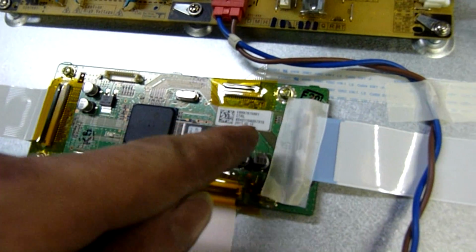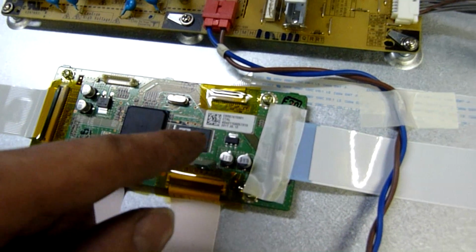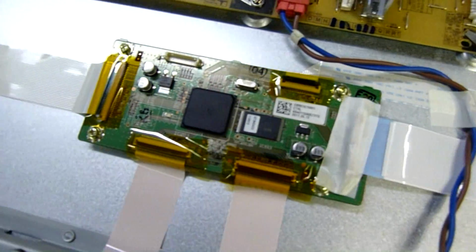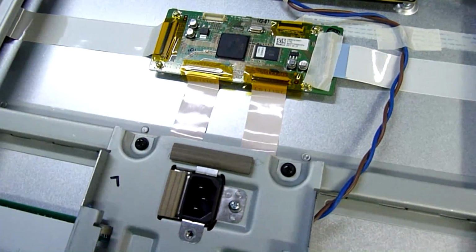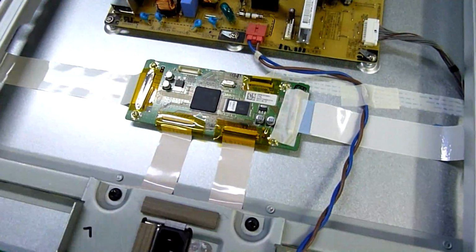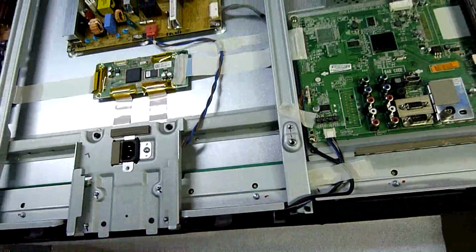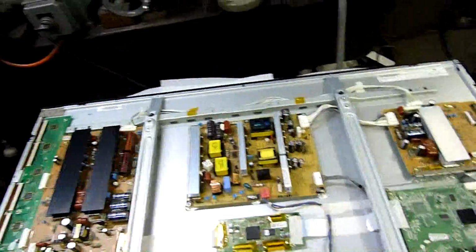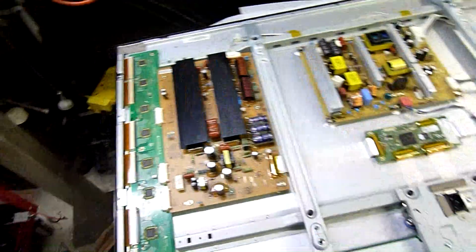Yeah, it's control part number KS42115A057315. It's got a little logic chip or something on there. Obviously it seems to control X, Y and Z sustain all in one. And Z's under there. So you've got vertical bars and horizontal bars. Just cold cathode fluorescent lights. Millions of them. And these things do an amazing job of controlling each one of them.